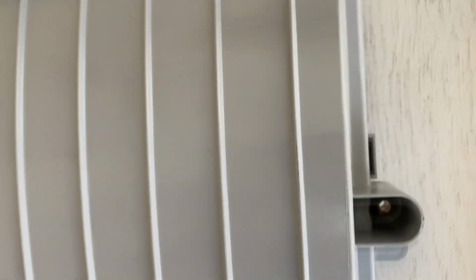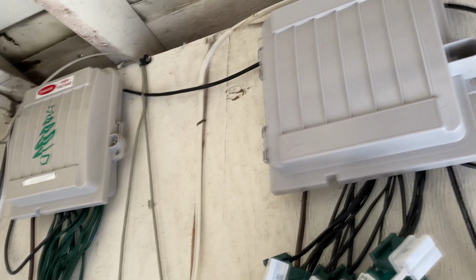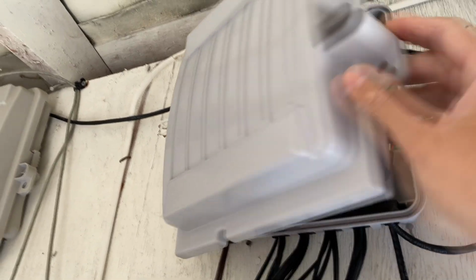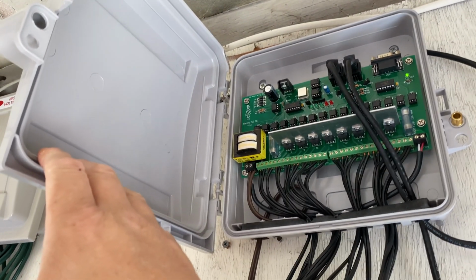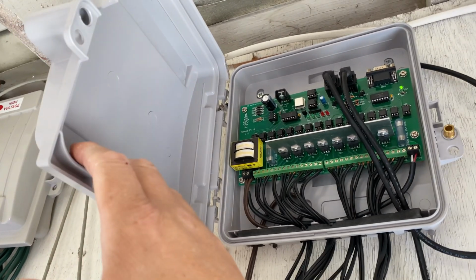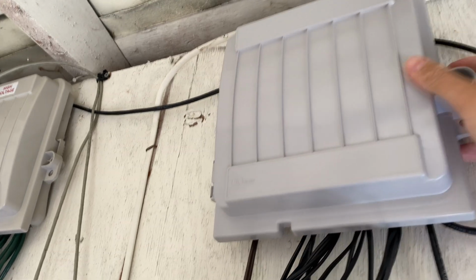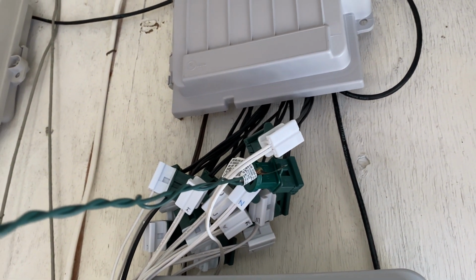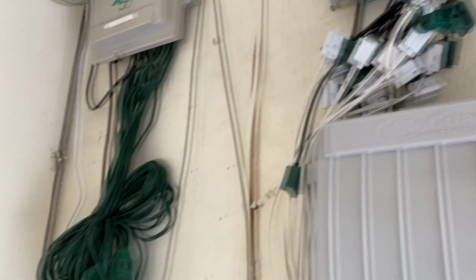And then that comes up into two SS16s for my AC lights. So at least here in the garage, I have 32 channels available. These are daisy chained together as one, although I never needed the second one. I only did 16 channels of AC light. These go through these white cables, and they go up and out and under the eaves to the outside, so that I can keep this all inside and patch it through. That's why I have them all numbered and lettered, so that I can use them like I would patch panels for Ethernet.